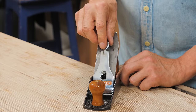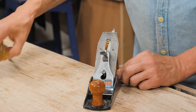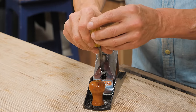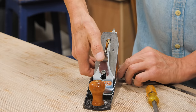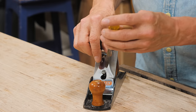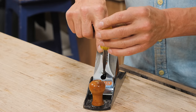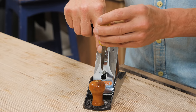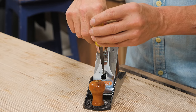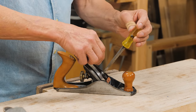So what I have to do is loosen this and turn the set screw — you can do it with your fingers, but you'll probably see more if I do it with the screwdriver. Then you tweak this. There's no pressure on it, so I go back in with the screwdriver and turn this while the lever on top is out of contention. I pull again with the lever and I can just feel it starting to bite.